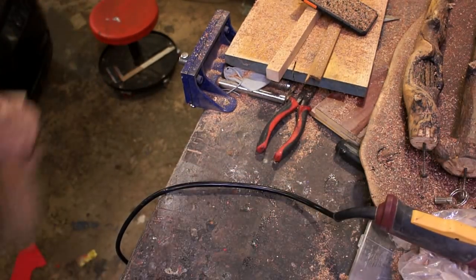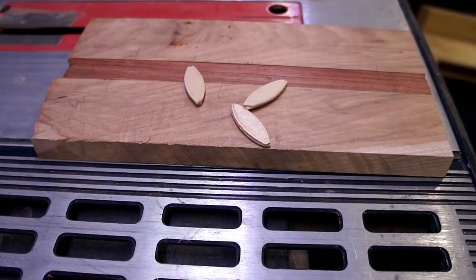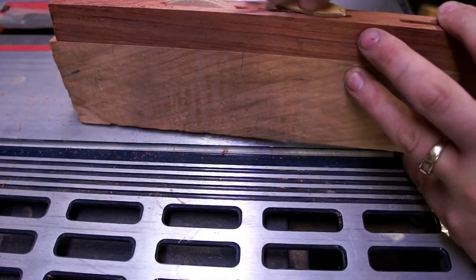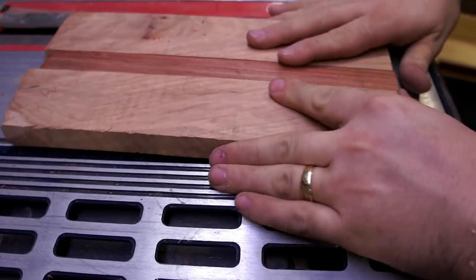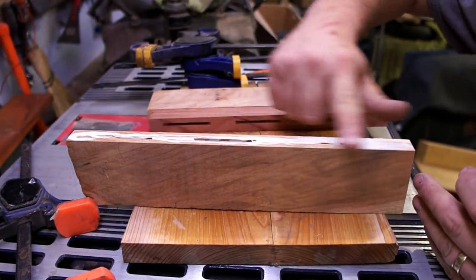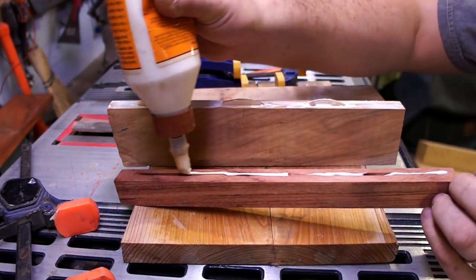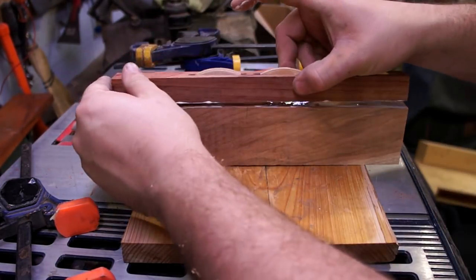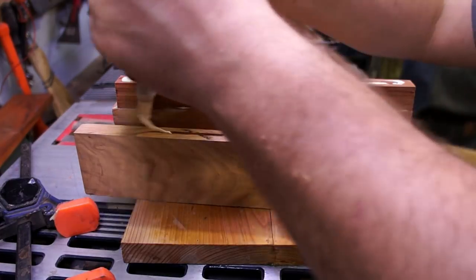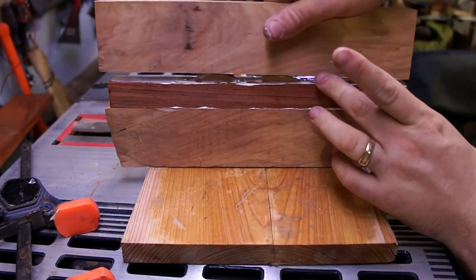The tool I'm using here is a biscuit joiner, and this is one of those gems of Harbor Freight — I don't think you need to pay a lot of money for a good one. This one has served me really well over the years. A lot of times with cutting boards people just make sure the surfaces are flat and glue them straight together, but I wanted extra assurance. Also, the grain is all over the place — you usually want the grain going the same direction so when the board gets wet it grows and shrinks uniformly, otherwise you can get cracking. I think using all these biscuit joints helps with that, giving more glue surface area and strength.